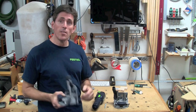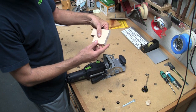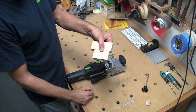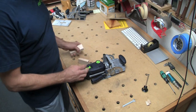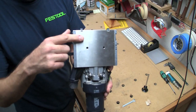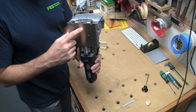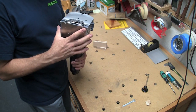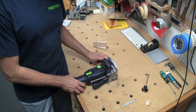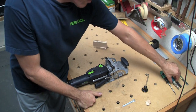The procedure is pretty fast so let's get right to it. For calibrating the cursor, what we're going to do is mark some lines and then try to join them together so that the panel has a nice smooth flush edge. If there's any discrepancy we're going to see it come out one way or the other, and we can use that to adjust the cursor. Now it turns out the bottom of the base has a line right here that shows you where the middle of the mortise is. This is calibrated at the factory so that line is dead on. Typically that line is calibrated to the center of the mortise and then the cursor is left up to you. What you're going to need is a Torx T10.